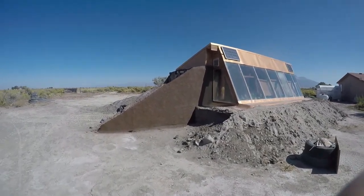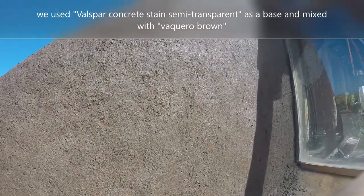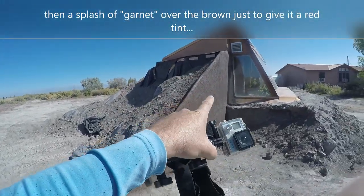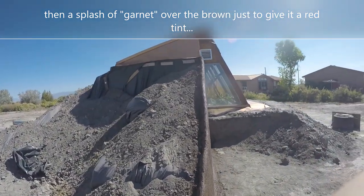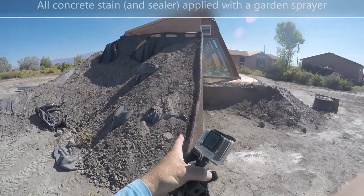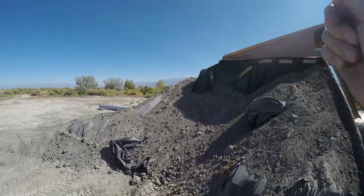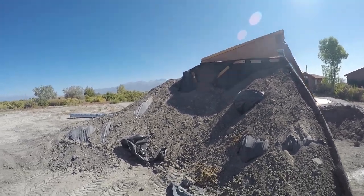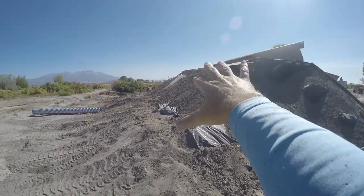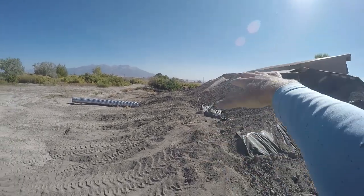Got the wing walls done and got them stained. We also got a coat of Thompson's Water Seal — I didn't know they made it for concrete, but they do. She used a brown with some red splashed in, so it looks kind of cool. There's a little wonkiness here but that's how I built it to tie tight to that tire bale, because the tire bales are crooked as you know. There's a big plastic layer laid out all the way down to the ground and tucked in under the metal, which will divert any water away from the foundation.